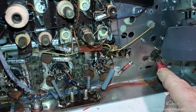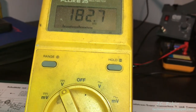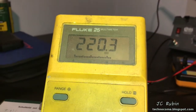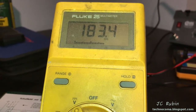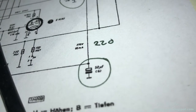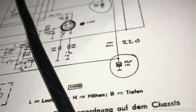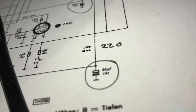Right off this capacitor here we're seeing 182 volts. I wanted to note that because if we're getting that right off the rectifier, it could explain the low B+ we're getting. I'm going to have to look at the schematic and reevaluate. There's another one coming off there too — that's also 220. So 182 and 220, and now referring to the schematic: the 220 is in fact supposed to be 270, so either something is pulling it down there or it's not delivering from the rectifier. We're going to have to start tracing back to see what the voltage output is disconnected from the rest of the circuit. No sense troubleshooting the rest of the radio if the output voltage itself is low.